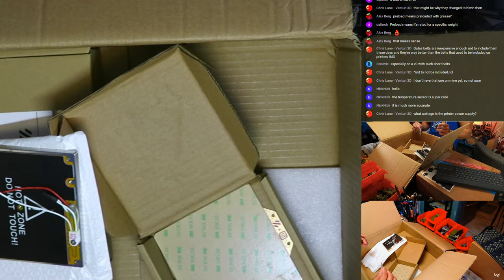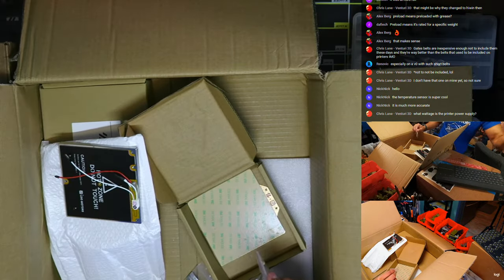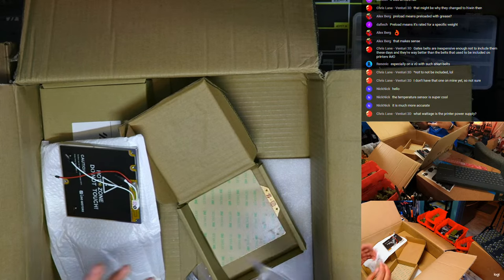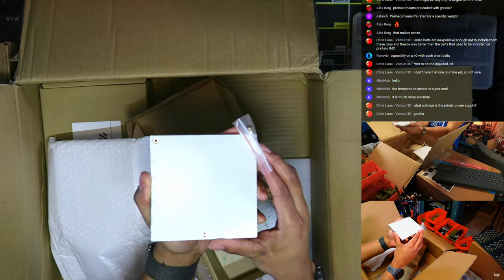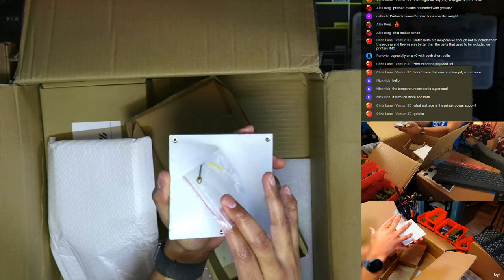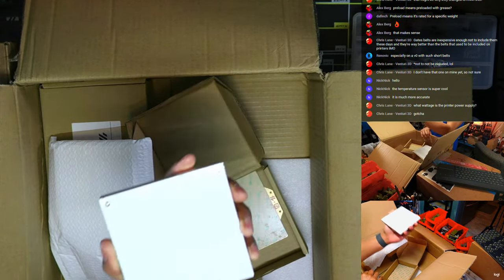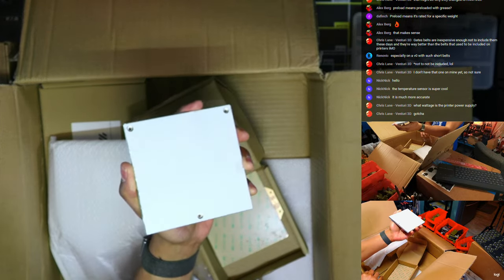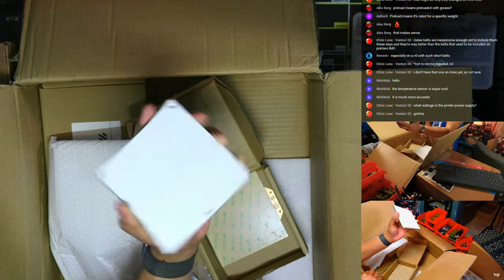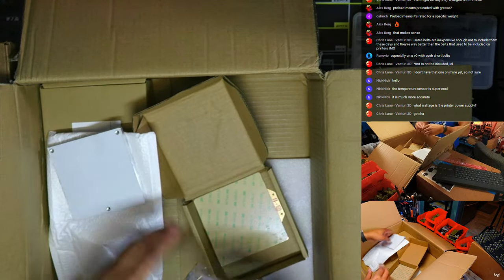You don't need to heat your V0 chamber super hot, but if I'm going to print something that's gonna take up pretty much the entire 120 by 120 by 120, and it's gonna be a lot of plastic, I do usually try to heat soak my chamber a little while. So having a more powerful bed, maybe having a Nevermore in there and a bed that can heat up and, you know, just is more powerful should be a pretty good thing to have.